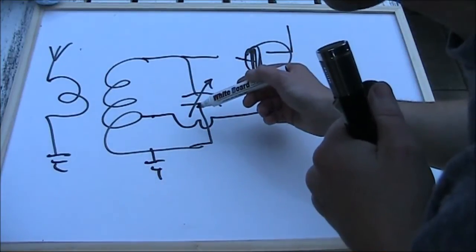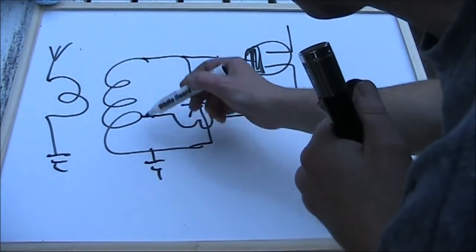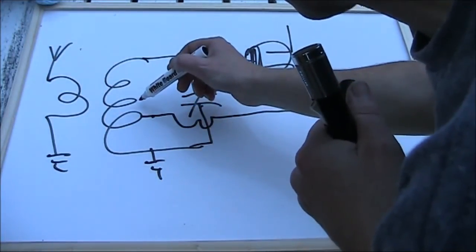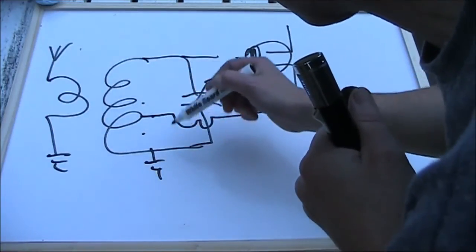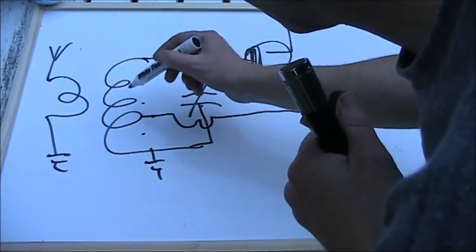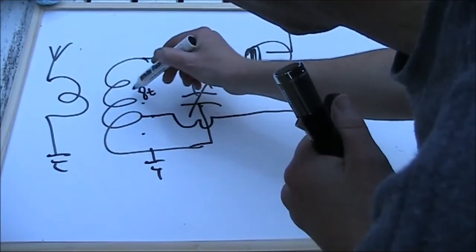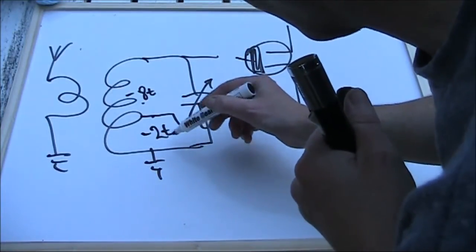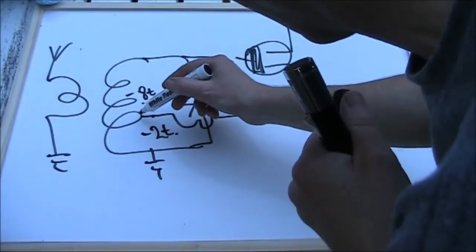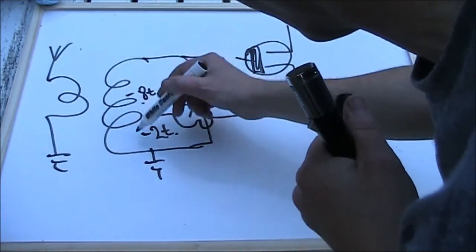Changing the coverage of this is similar in principle to the previous receiver. The only thing is that you should remove a proportional number of turns above the tap as below the tap. In other words, if you were to take 10 turns off the whole lot, then you might take 8 turns off the top end and 2 turns off the bottom end. Although all this is still subject to getting satisfactory regeneration, and you might need to change the ratio slightly.